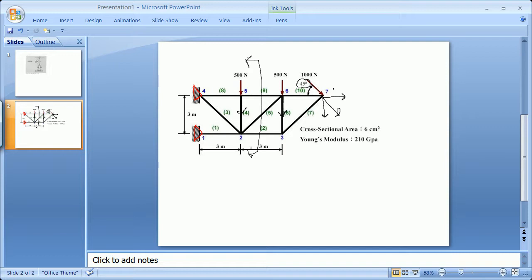We do not need to solve for reactions, but we can solve for reactions if you want right now by using the kind of more or less rule, or because some of you are fixated, and it's a good thing to be fixated on, the sum of the moments about point 4 is equal to 0. And those of course are equal to, we'll deal with the first one, in a negative direction, 500 newtons times this distance 3, and that is causing it to spin into the board, or negative, and then the other minus 500, this times 6.